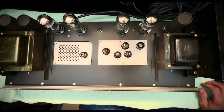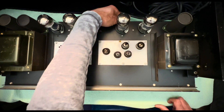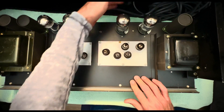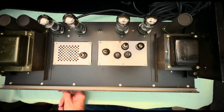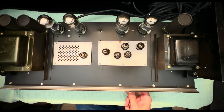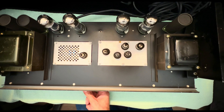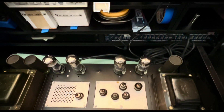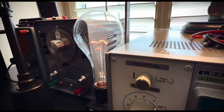What's kind of cool on these — there's a little lever that will mute. And it already sounds microphonic. There's a lever on these that will mute the reverb springs. Now she's free ranging. Sometimes you can hear your voice reverberating. We've got some scratchy potentiometers — noisy, noisy pots. She's crispy. Maybe I can move you over just to take a peek at where the current limiter is. This is where we are with respect to the light bulb limiter — nothing significant at all. This is fine.